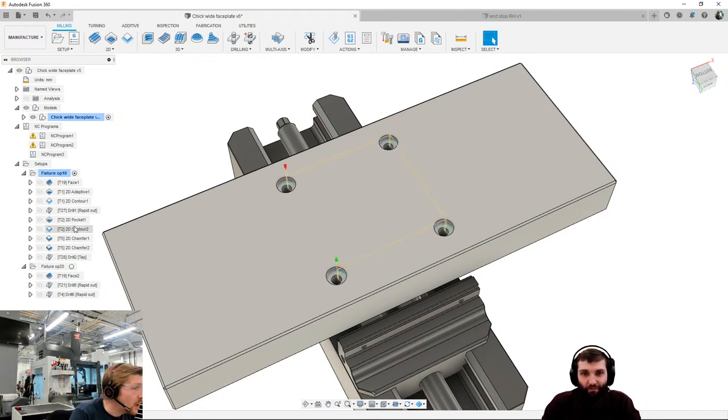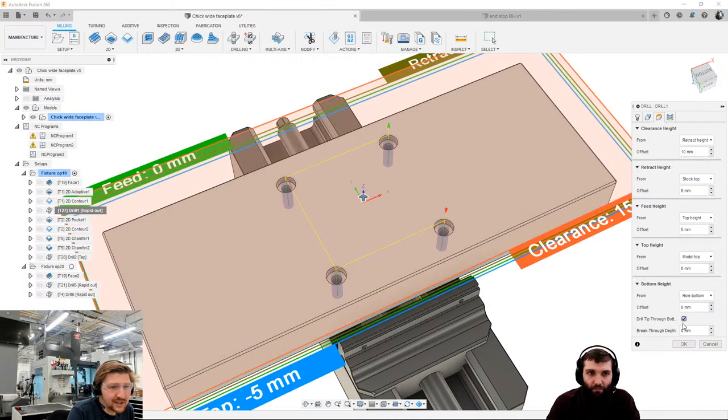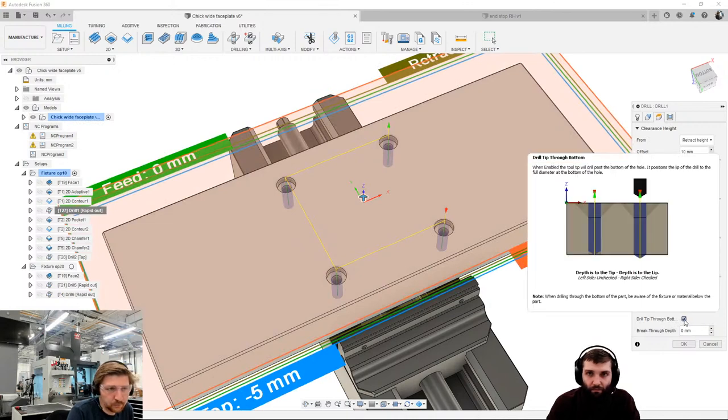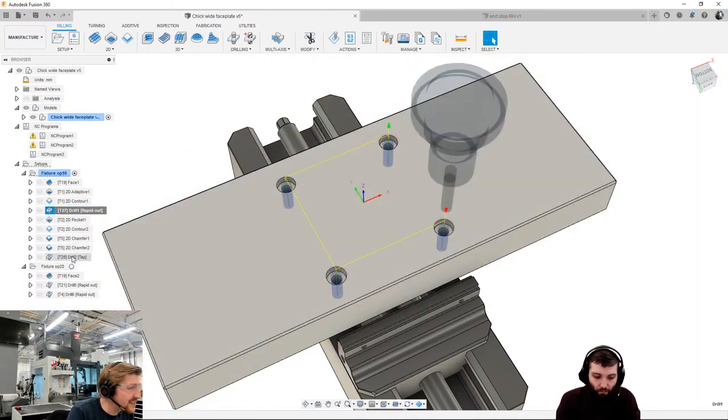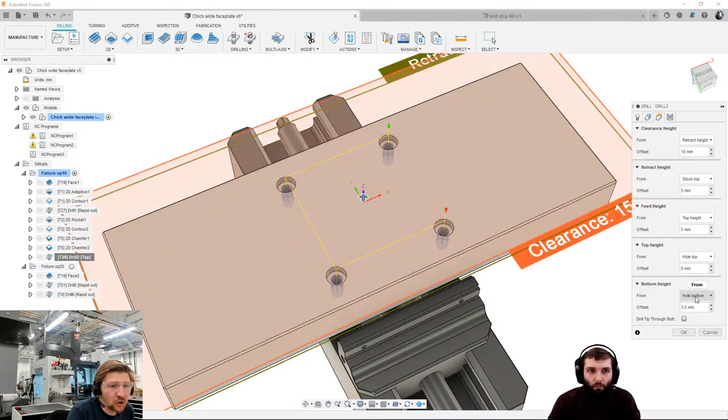Right, lovely. So my tapping top tips that I showed everyone. So my drilling here, I drilled down to the bottom of the hole. I then tapped, and you've got to make sure you do this properly, is you have your height, and then I've come back up 3.5 millimeters. So what I've done here is that I effectively looked at what was the minimum amount of thread I could get away with on this component. And that was 3.5 millimeters back up from the bottom.